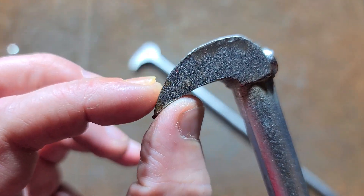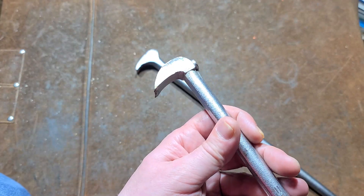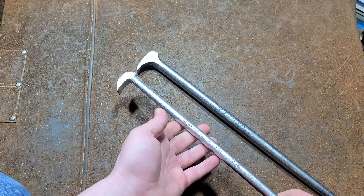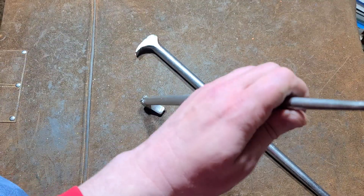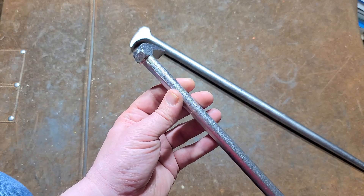This taper alone can provide just a lot of advantages for splitting things open — transmission cases or a variety of other prying applications. That's what you'd use one of these right angle rolling head pry bars for. And of course they're called rolling head because you get them into a spot and then you roll them over like that.